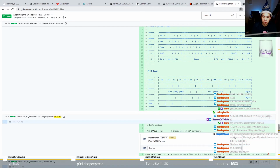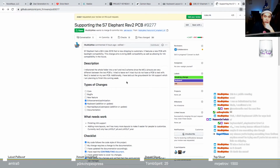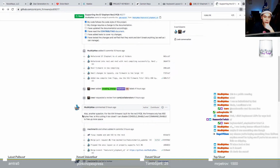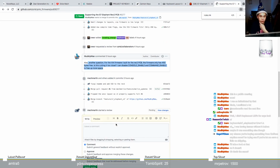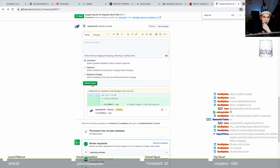So I did notice, Mr. Mudkip Mau, on one of your comments here, you said, also, another question. For the VIA firmware I built for the Rev2 PCB, the firmware only has 450 bytes free. Is this cutting it too close? If you set LTO_ENABLE, you may get some space back. Maybe. We'll see. Yeah, so that will be my only comment.